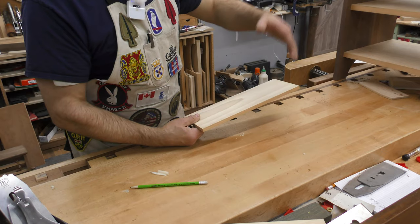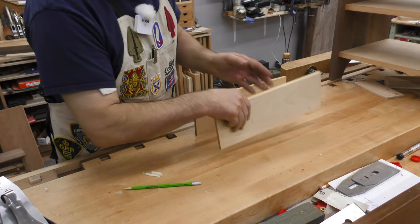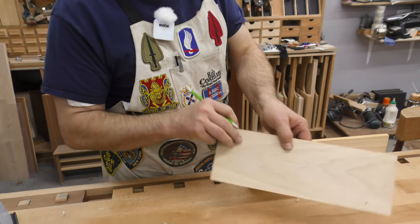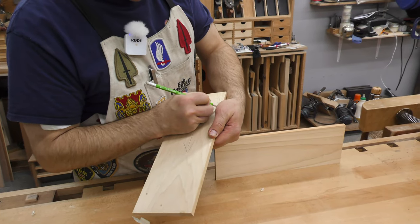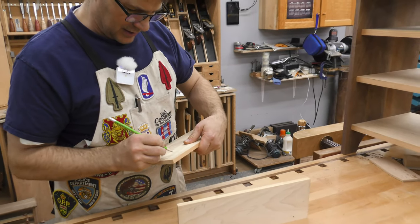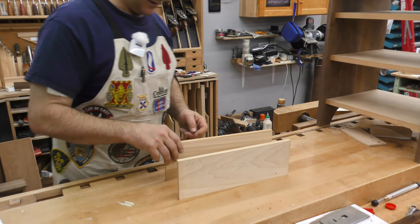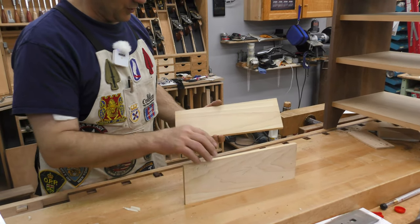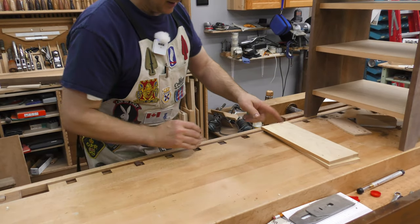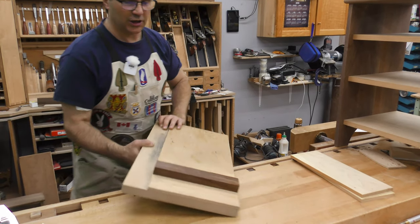If you're going to damage anything, it's on the back side of the drawer. So with the arrow oriented that way, I'll orient the two pieces accordingly — this will be top right, number one. This is the drawer we're doing up here, and this would be top left, number one. Next move: I want that bottom edge to be perfectly straight. Once we straighten that out, we never touch it again. All the fitting is going to be done from the top.